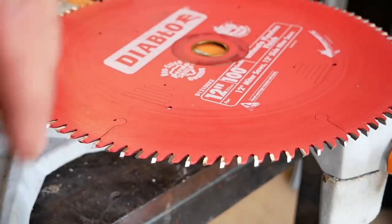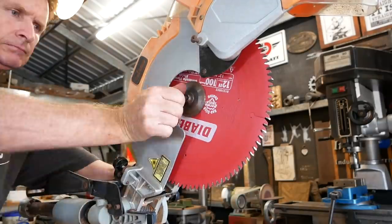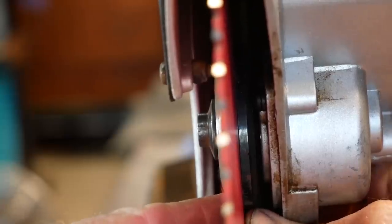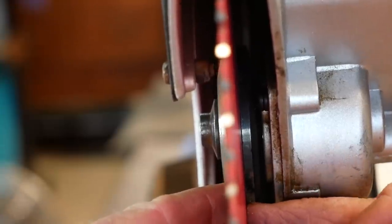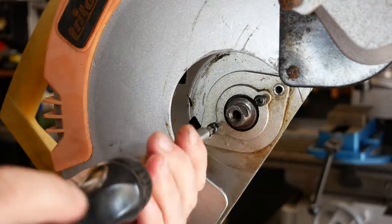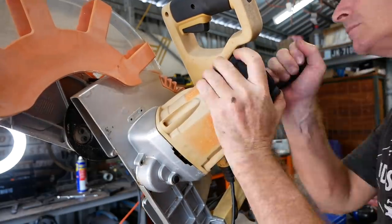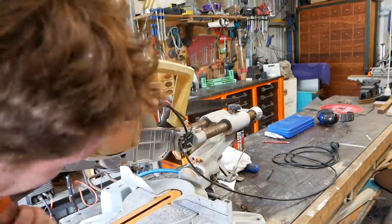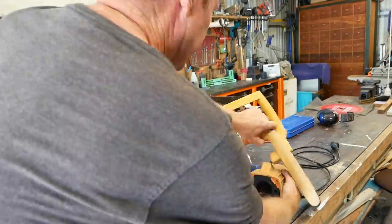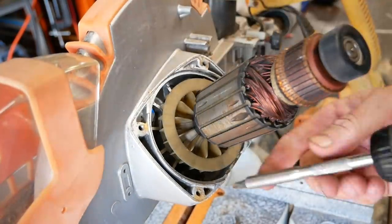Removed all that resin — let's put it on and see how much wobble it's got. Still got a bit in there, and that's a lot of play. At this stage, I just need to make an important point: I'm pulling things apart trying to solve the problem of the end float in the shaft — the arbor float. I don't recommend doing this. As part of the discovery process I end up shimming the plate out, which I don't recommend because you're changing the design of the machine. You don't know what's worn behind there, whether it's a bearing or housing that's worn out. So I'm recommending that you don't do this.